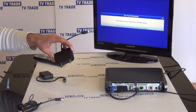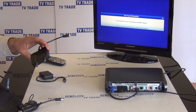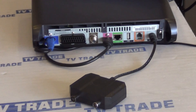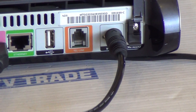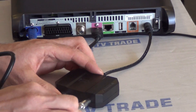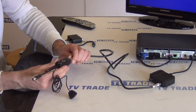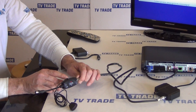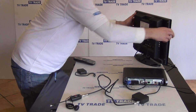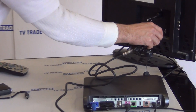When you run it through your television you'll have both the base feed for the Irish terrestrial channels plus also the RF out. So I'm going to connect it in here like this. I'll take a cable from the RF out — I have this cable here — connect it, and we can see the Sky eye has lit up. I'll rotate around to the back of this television and push this in now.